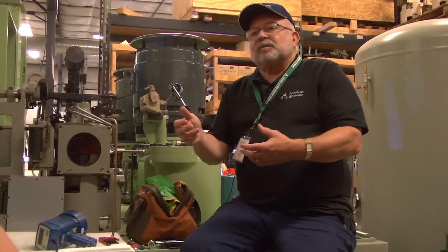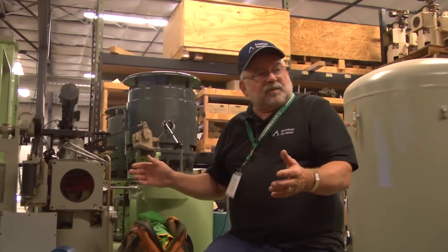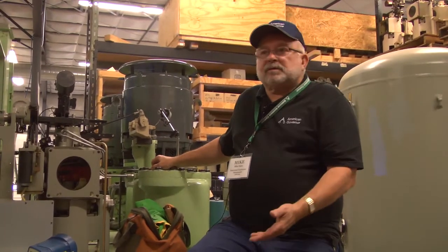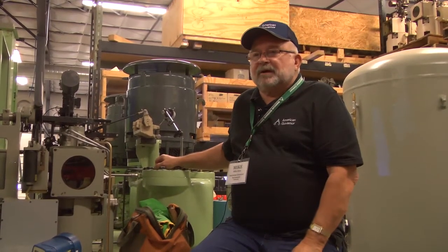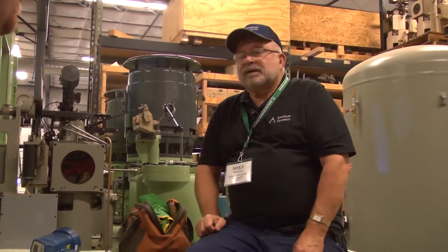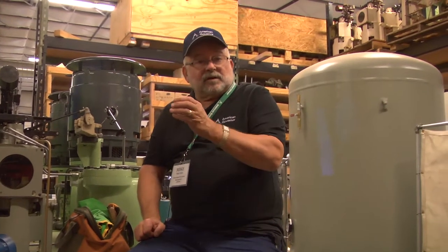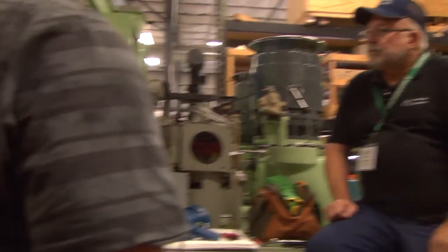But that's telling me that it wouldn't hurt to clean it. When you have it isolated from the pressure altogether in the air. Absolutely, to pop a top off and see what it looks like in there. I mean, I've seen it when it wouldn't even come out. You got to put a 4x4 up here and a chain fall and pull a jean and swap the poppets. And then you got to have a little ring compressor to get it back in. Take some of those units that run all year long and never shut down. And they're going to build up stuff.